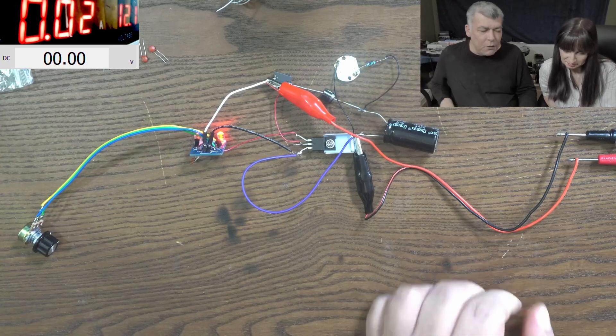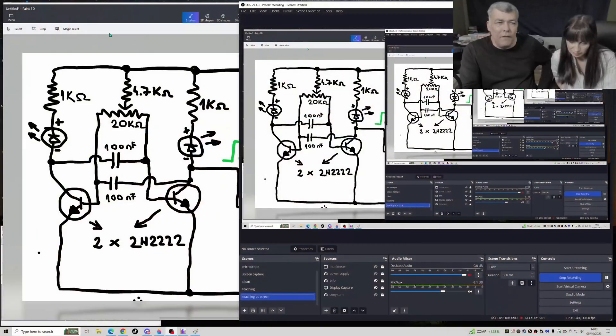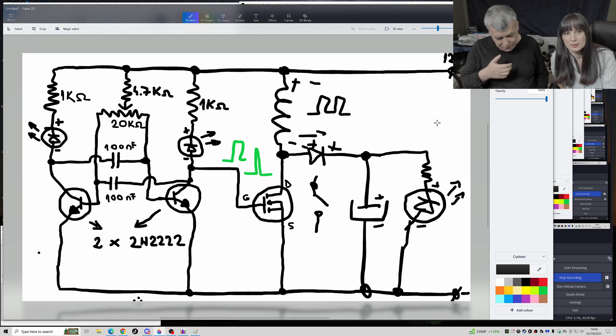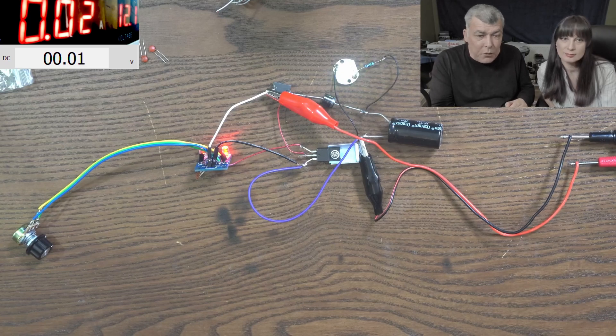So tell me what you didn't understand. I understand everything. Look at the schematic and tell me. The MOSFET charges the coil with high current; the coil bounces back with high voltage. The high voltage passes through the diode — it's bouncing back with inverse voltage. Initially you apply plus here, minus here; when it bounces back it's plus on the other side. It passes the diode and the capacitor smooths it — that's the output. Then you have your load. Everything is clear.